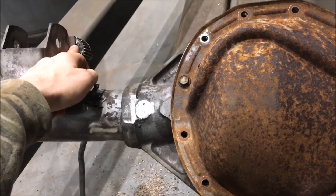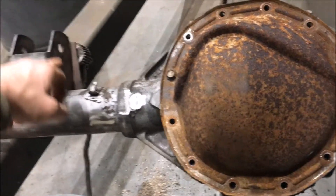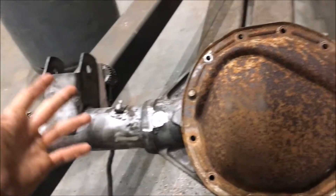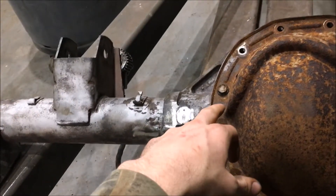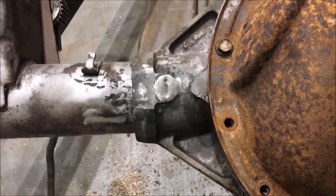You could get away with it if the ground and weld point are very close together, keeping the travel distance short. But because the bearings are right there, I wouldn't risk it. Just empty it out and do it that way.